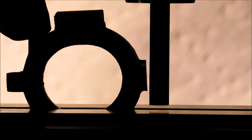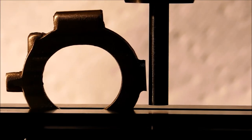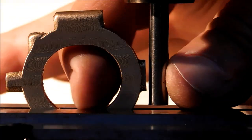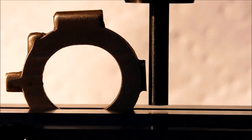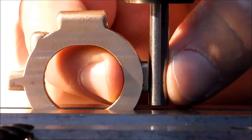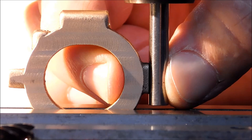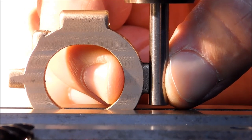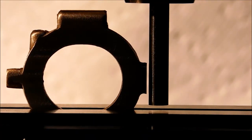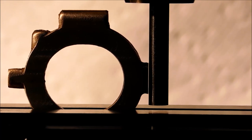Lining up for the 256 oil cup feature that goes right here, I am going to use the same shadow technique that I used on the sides, but now I'm going to use the pad that I left on from the gate. I'm still on the y-axis 0 for the center of the part. I'm simply going to squeeze these two and let these two come together and re-secure the vise. I'll get a little closer to keep the part in the middle of the vise. Back it off, watch the gap go away. And sunset, there you go.